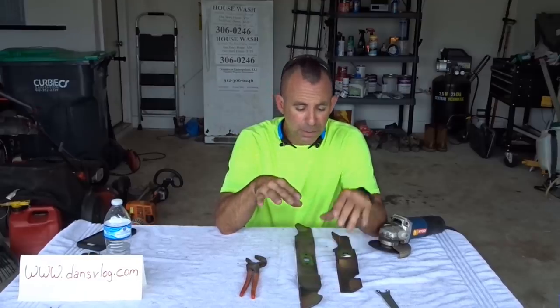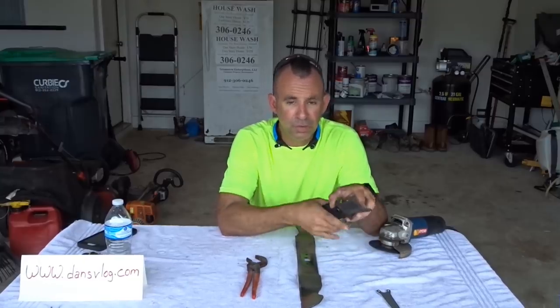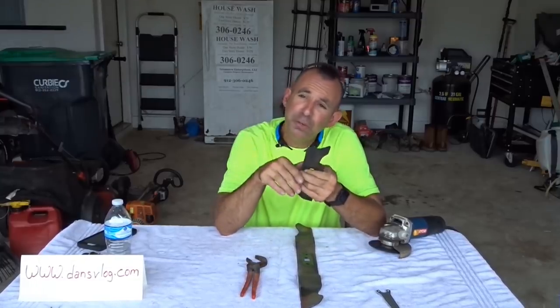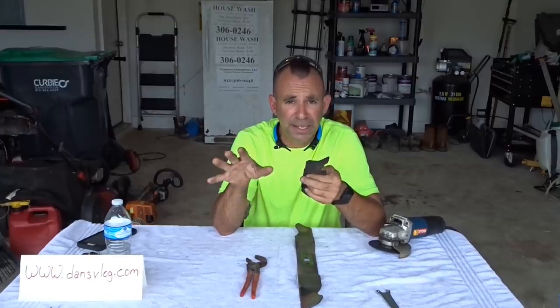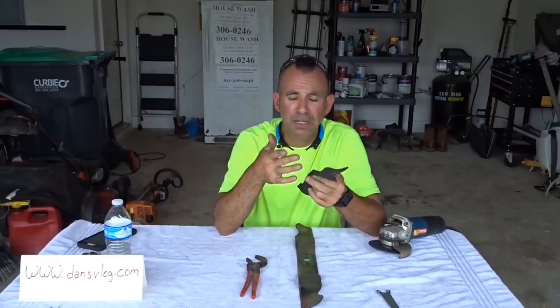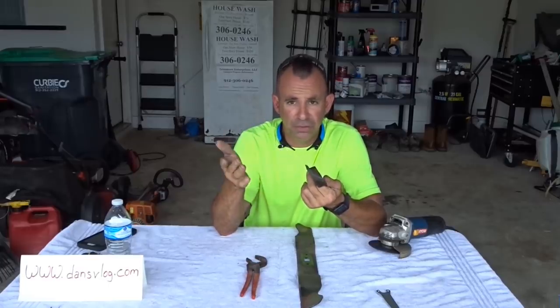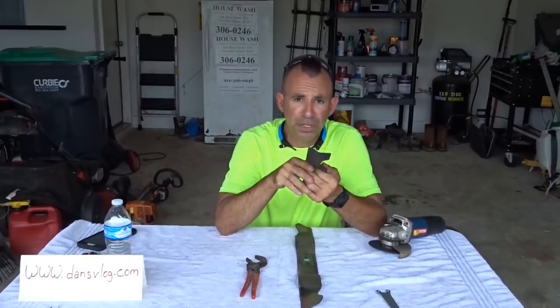All right, guys? Anywhere that you shoot your sparks is metal in the air. Anywhere it lands will rust. So if you're in your garage and you're sharpening lawnmower blades, and you're doing it right next to your old lady's car, you're going to rust her car. You're going to have little teeny metal fragments flying through the air, and you're like, ooh, pretty, sparklers. Well, those sparklers land as little teeny metal flakes that are not protected by any paint or any type of protection. What ends up happening is you turn around and rust whatever it lands on. It just starts to rust, okay? So be really careful where you point it. Make sure your vehicles and anything that you care about are not around.